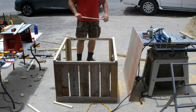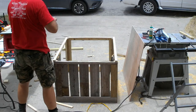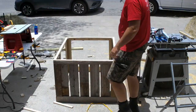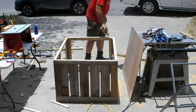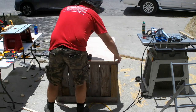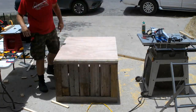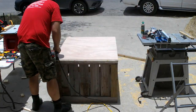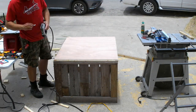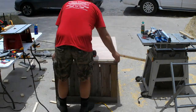In the previous build I assembled the top by gluing and clamping the strips in place before I stapled them, but I felt like it was kind of fiddly. So in this build I laid the strips out on the frame as I wanted them to sit, applied glue, and then laid the plywood on top. After a few adjustments I was able to staple everything down — it seemed a little faster and easier and I may use this method again. After gluing and stapling the strips in place, I laid the lid down on a flat spot in the driveway and applied about 280 pounds of boot force to the edges to make sure the glue spread out well and there was sufficient contact between the strips and the plywood.